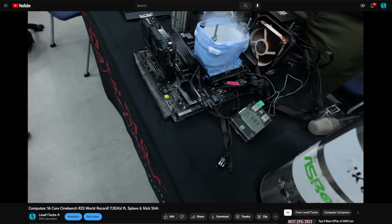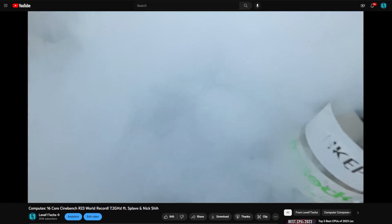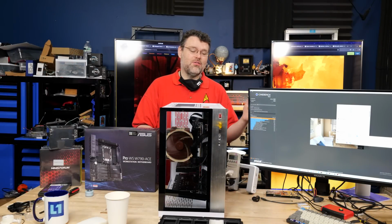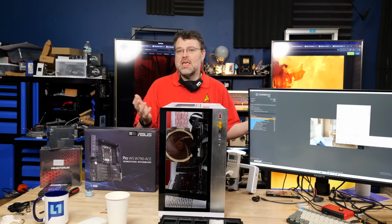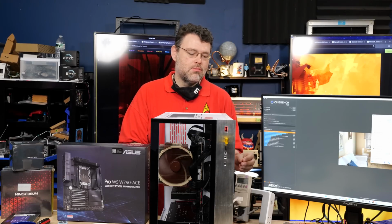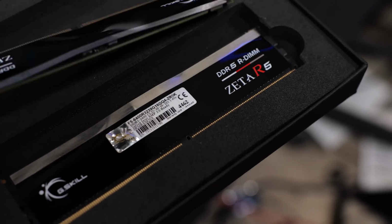Literally done it. I made the 16-core Sapphire Rapids Xeon. Well, okay, it wasn't me, it was Splave and Nick, but we made the Sapphire Rapids, the Royal we, go as fast as this 24-core system is going in multi-core, but at a cost of about 900 watts. Whereas, according to the kilowatt, on this configuration, we're peaking at about 600 watts at the very highest end configuration, but our configuration that's at about 322 amps, keeping us well under that 90°C threshold for extended Cinebench runs, is more on the order of 450 watts at the wall, which means that our cooler is dealing with substantially less than that. Yay!